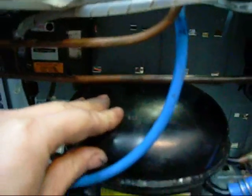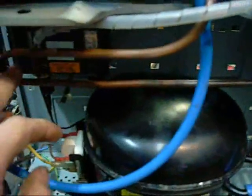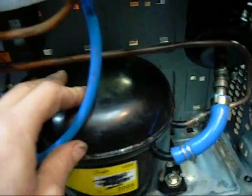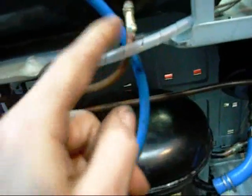The inlet doesn't have to be pressure tube or anything; I'm just using an old filter dryer. Wiring is going to go through that pressure control in there. The discharge line - I've left a long loop in it so that if there is any wobble in the compressor, because it is on rubber mounts, it won't stress crack or fracture the joint of the tube. Gives it a bit of survivability if it gets knocked about, whereas if you just went straight up there'd be no flex and one of these solder joints or the copper itself is going to crack.